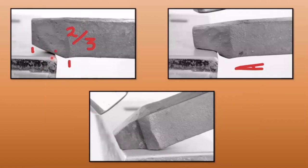I don't want a sharp edge. I start flat so I can set the shoulder, but as soon as I've set the shoulder and I can, I want to lift up just slightly, and I want to start to create that taper to the bridge of his nose down to the snout. And then you'll see on the bottom photograph, I'm just dressing any growth in width as it occurs.